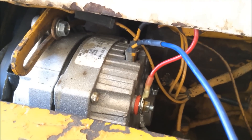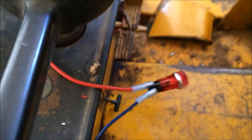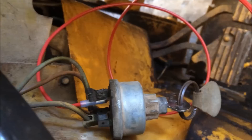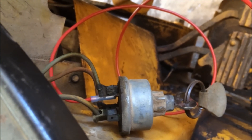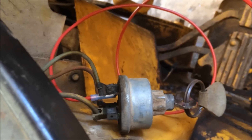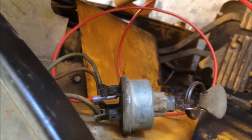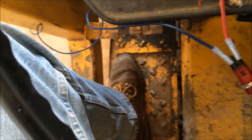I've got the crude wiring done. I've got number one jumped onto that post there with a fork connector — I would have preferred a ring terminal but didn't have any that fit 12-gauge wire. The blue wire comes out and goes to my little light, and it's temporary. On the other side I have it plugged into the run position on the key switch. I'm not sure if that's exactly right, but it makes sense to me — when it's running it's getting 12 volts. It shouldn't be on the start position, because in theory if the tractor is running and not charging the light should be on, which means it needs a steady supply of 12 volts.